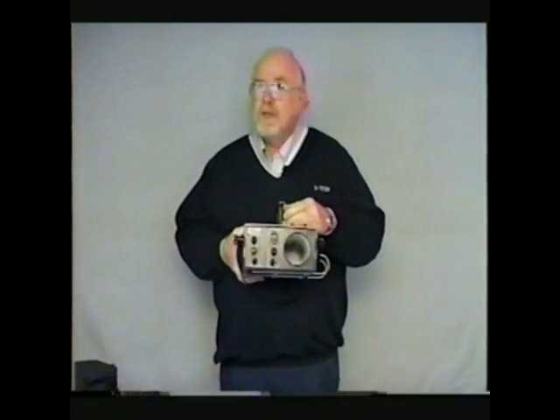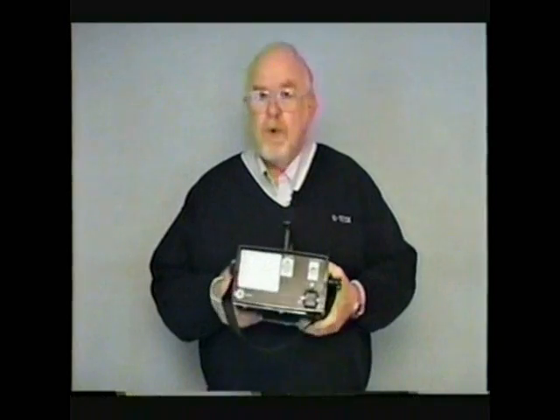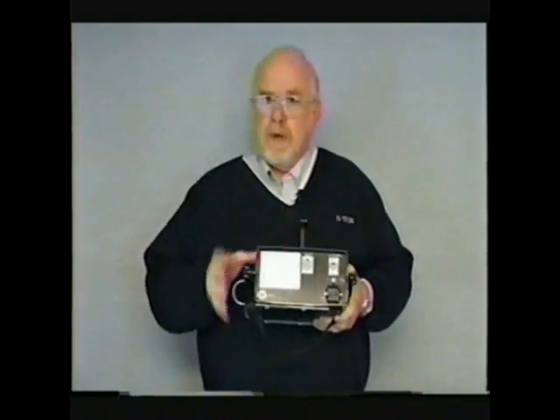As I mentioned previously, the CMU or Central Monitoring Unit contains the switches that allow you to turn the unit on and off, and the visual indicators that allow you to see whether the unit is operating properly. It also contains visual and audible gas alarm indicators. All the connections for both the remote sensing unit and your AC and DC power are provided at the rear of the CMU.